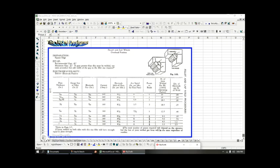We're going to go back to our little friend quarter inch thick plate that we've been using in the whole video. The weld size is 3/16. It's a single pass, so we're only looking at one pass bead all the way down. The electrode size is huge. It's 3/16. Remember, in hand welding, we're just using 1/8 inch. The current is way down, which is very interesting.